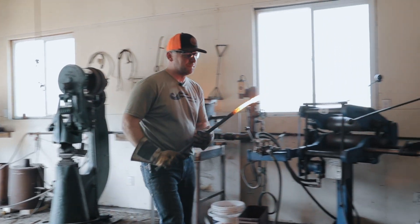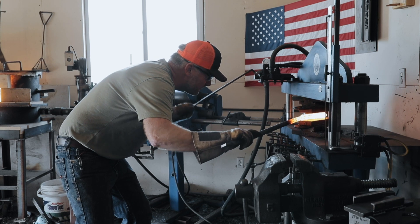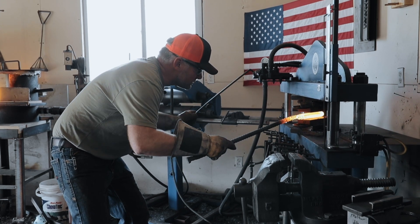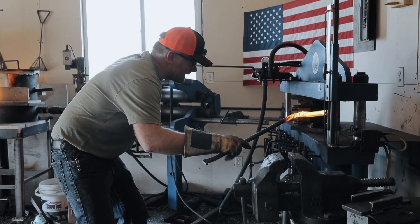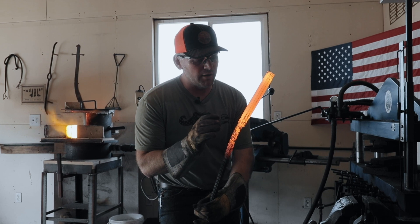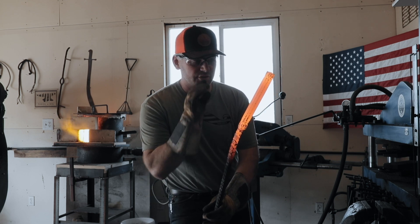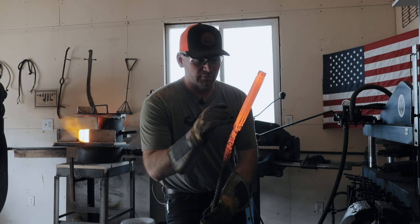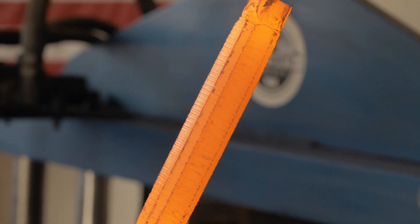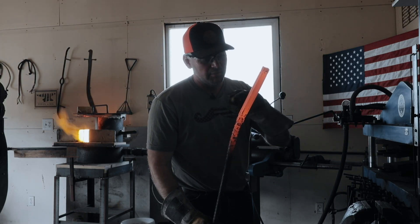On our first squeeze after the twist, this is where people tend to screw up. We just have to go easy all the way around and work those little twist points that are sticking up back down into a solid bar. We don't want to squeeze the heck out of it because we can actually split that bar open on those spots. Now we've basically got an octagonal bar — I've pushed all those little points down and solidified it, so I can actually start to draw it out. If anything was bothering me crack-wise, I'd flux it, get it really hot, and work it slowly.